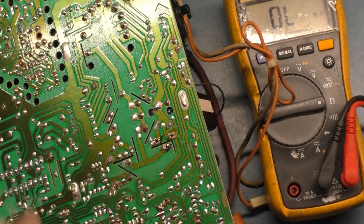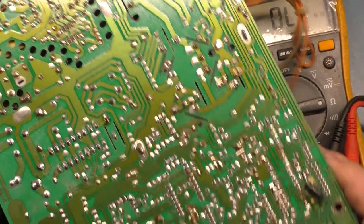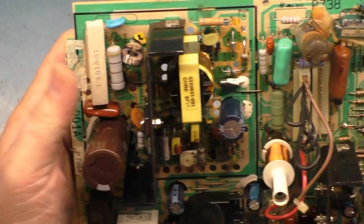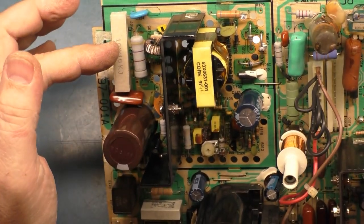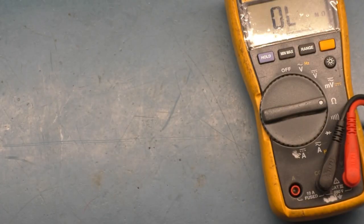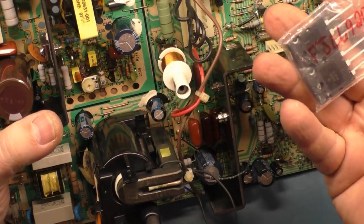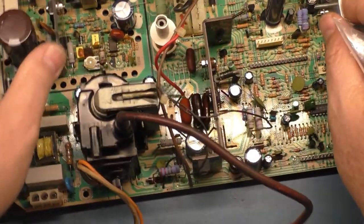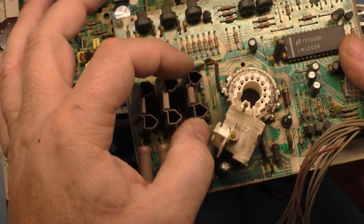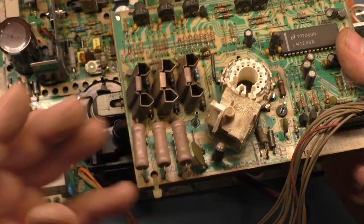So, all right, I think my theory, or actually technically my hypothesis, a theory is a proven hypothesis. I think my hypothesis is that we had a bad R104 and the missing resistor and bad header pins that took out the HOT. So I'm going to replace the HOT. I'm going to do a full cap kit. I'm going to do a full reflow, fix up the neck board, get everything situated, and this one is loose actually after all. Get all this stuff fixed and lined and repaired.